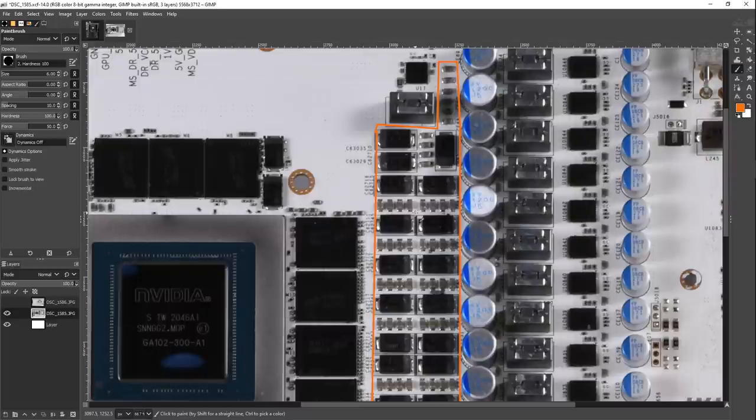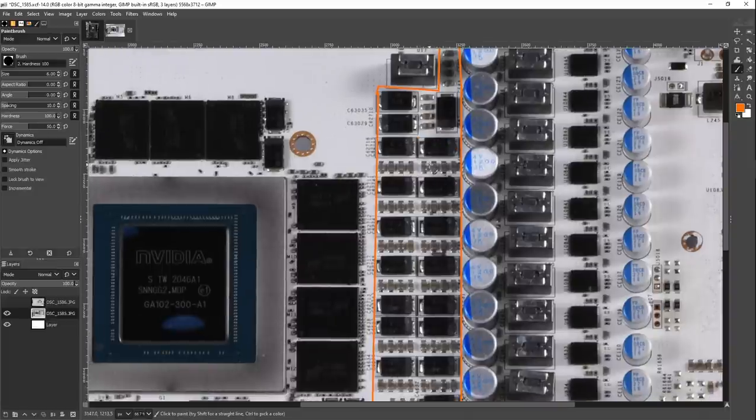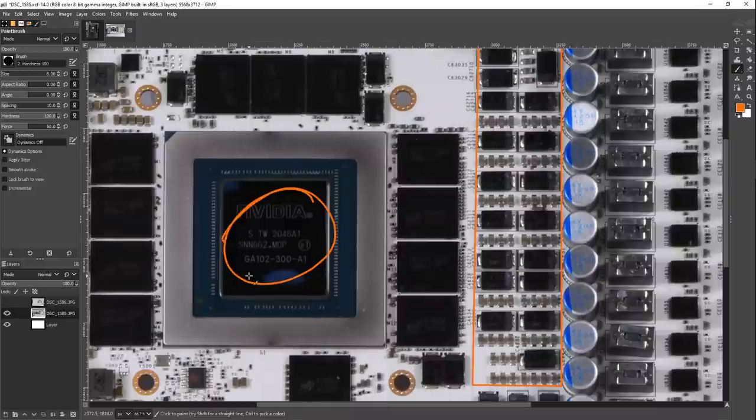The reason this is done is because your multi-layer ceramics have really low ESL, and ESR on par with the SMD polymers. Normally people think multi-layer ceramics have low ESR — not really. You can get SP caps in 3 milliohm ESR. These normally go to around 3 to 5 milliohm ESR as well, so it's not like they're necessarily significantly lower ESR than the large polymers. But they do have significantly lower ESL, and that makes them much better at suppressing higher frequency switching noise coming from the GPU core.